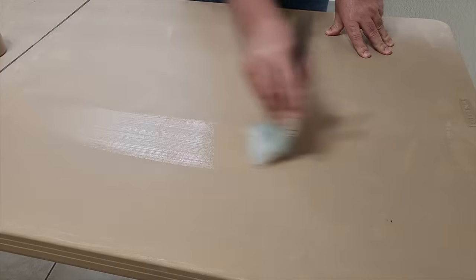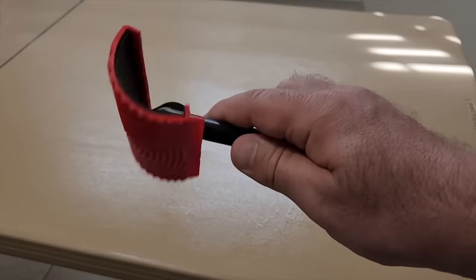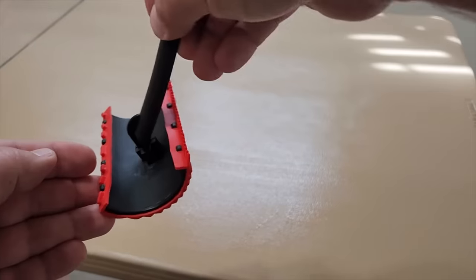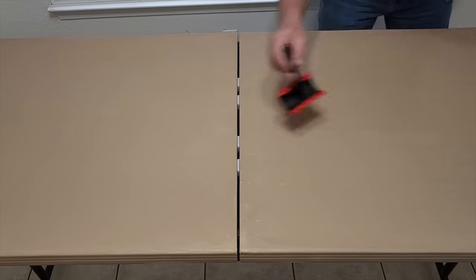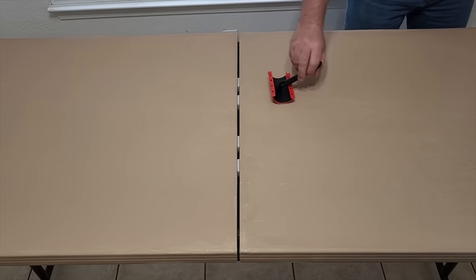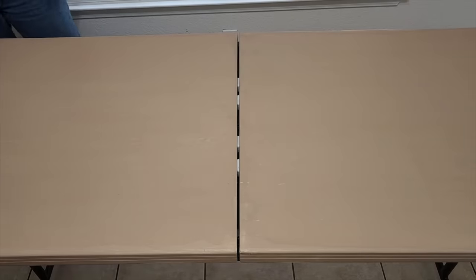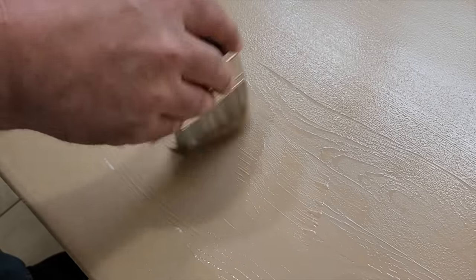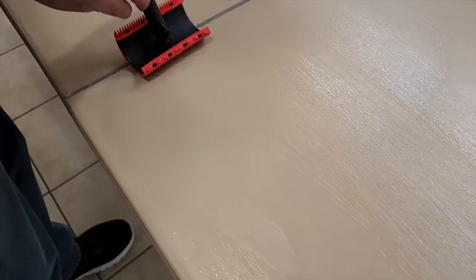We're going to go ahead and put that second coat on because this is the one we're going to work with. On the second coat I did put it a little thicker than the first one. Make sure it dries two hours in between. This right here is called a graining tool — it is absolutely perfect for what we're going to do. It's going to give that table a good old-fashioned wood look. Using a rocking motion, you're going to take that graining tool and go back and forth. Look at those grains come through — it actually looks like an old wood table. There's actually no wrong way to do this; just keep going back and forth rocking the graining tool as you go. Start on one end of the table and go all the way to the other. If there are any imperfections, before it dries go ahead and take that paint and put it right back on. You can go over the grain you've already done, and using a rocking motion again with your graining tool it just takes care of that.